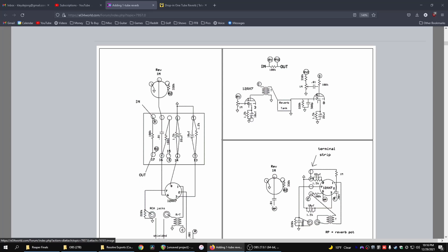There's a basic 1.2K bias resistor on the cathode with a 10 microfarad cathode bypass cap. It goes from the plate into a reverb transformer — you can use any Fender blackface style reverb transformer and it would work really well. The other end of that transformer winding goes to your B+ supply at the C node, and you do need a high, around 250 volt DC B+ supply from your power supply. The other end of that reverb transformer goes to ground on one end, and the other end sends out to your reverb tank. I'm going to be using a three spring Mojo Tone reverb tank, but I've also got a two spring which I may test. A standard typical Fender reverb tank works great.